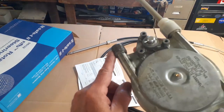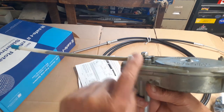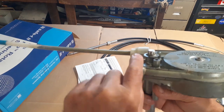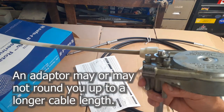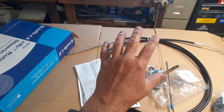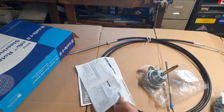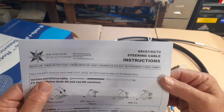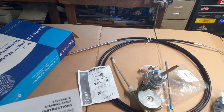Like the original. So that is one of the challenges — if you're just replacing a cable, make sure you get a cable suitable to your helm type. In some cases they make adapters too, so if you had a threaded connection you could put on an adapter and use the pin type. I'm not an expert on that; I just researched and was happy to get the entire assembly. The documentation can be confusing because there are different versions. This old one I have is actually from a 1971 boat.